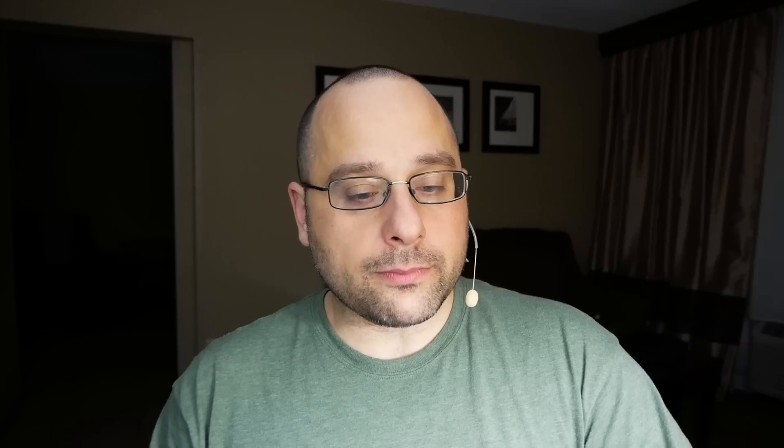Another thing we did was put gummies in the corners. I soft mount all my flight controllers with rubber standoffs, and that works fine, but the rubber standoffs aren't always the right height — it doesn't always work great, especially in a stack with multiple boards where the extra height makes it hard to fit, particularly in tight frames like the Armattan Chameleon. You also have the approach taken by the Holybro Kakute, which I worked closely with Holybro on. The soft-mount gyro on the Kakute was actually my suggestion — I'm proud to say I was the one who suggested they give that a try.